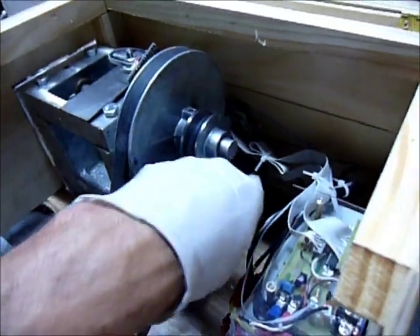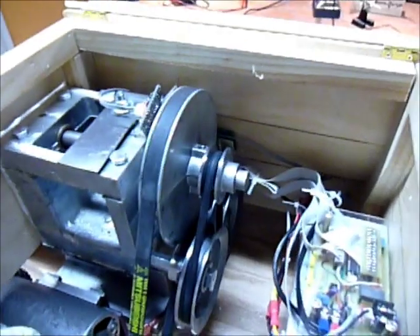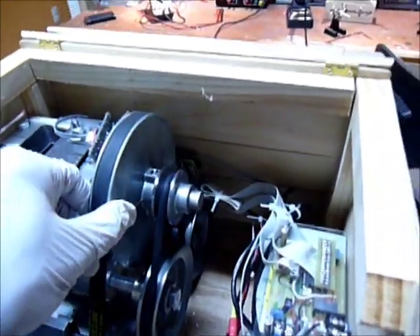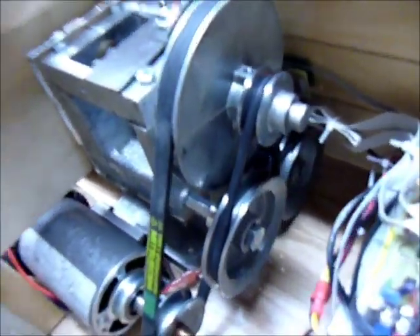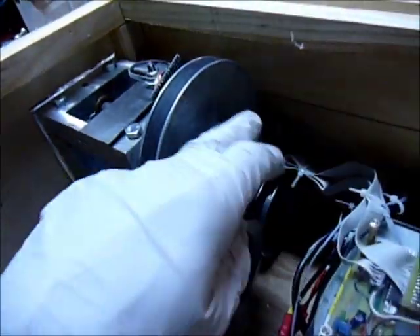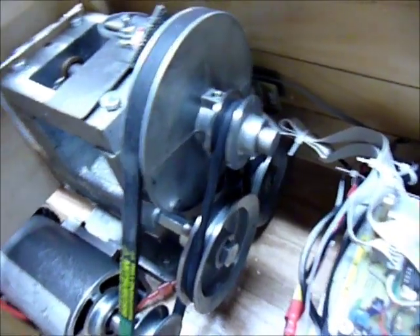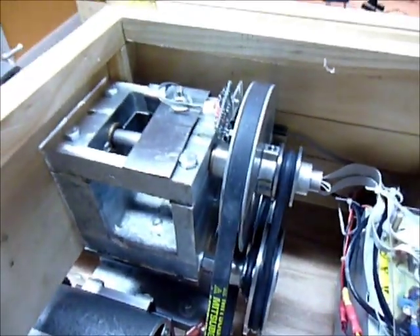This setup for the drive is a little bit different. The regular Gingery has the pulleys inside here, and this stuff is kind of right up here. But since I'm outboard with this pulley, I kind of had to finagle it — it's kind of tight but it works pretty well. I had these extra die cast pulleys that I just used. As you can see, I was playing around just cutting the lip off with the lathe on the pulleys, and that comes out pretty good.